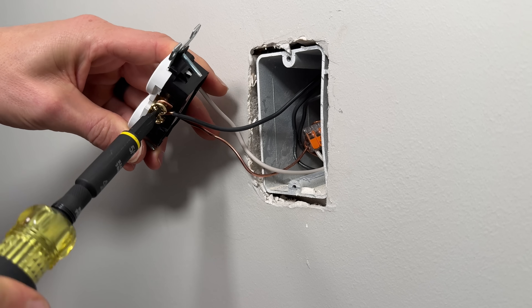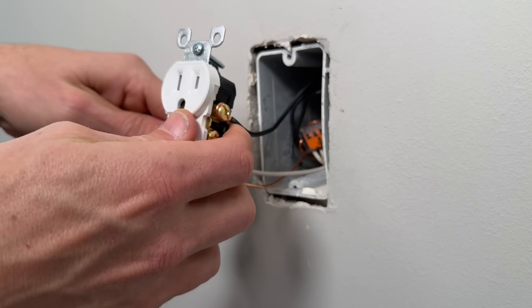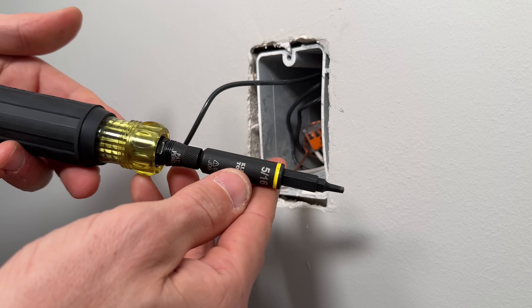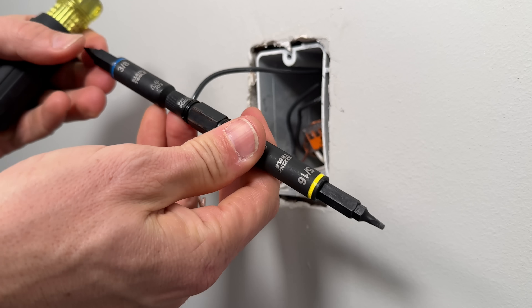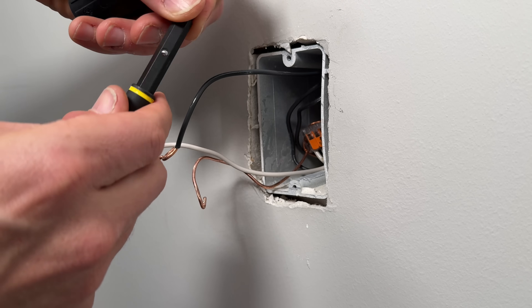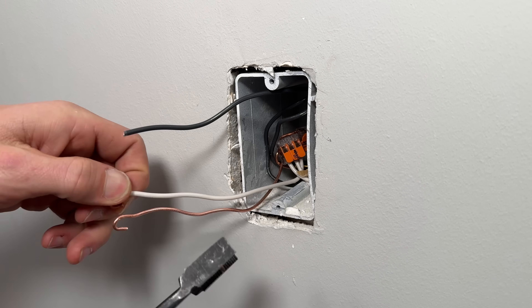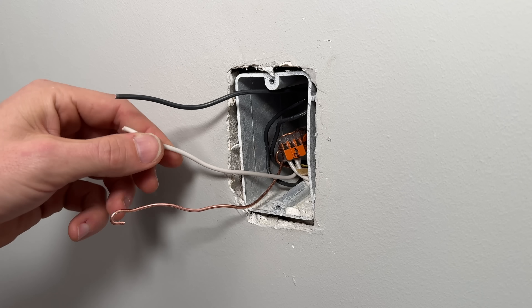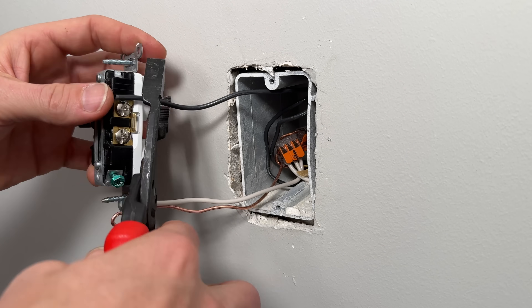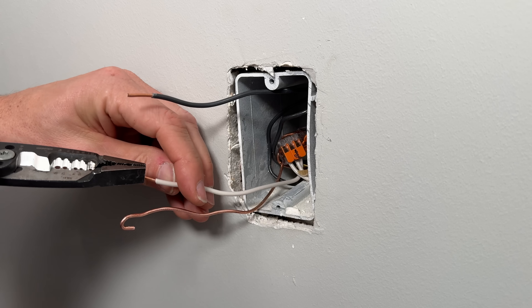I'm going to upgrade to the commercial grade to show what I really recommend for DIYers in terms of wiring. Undoing these screw terminals, you'll see serviceability on these J-hooks is a little tougher — it takes more time to get those off, and sometimes you have to cut your wires a little shorter to get some clean copper stripped off. I recommend a multi-bit screwdriver like this one from Klein Tools. It has Robertson heads that are perfect for this type of work, superior to a flathead or Phillips when tightening down screw terminals. It also has nut drivers — you'll see a link in the description. I'm going to snip off the J-hook for the black and the white, leaving the copper. Then, referencing the strip gauge, I'll strip off insulation to expose the copper for the hot black wire and the neutral white wire.